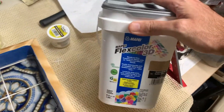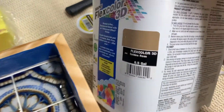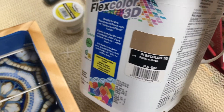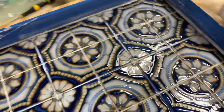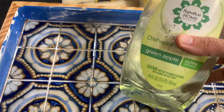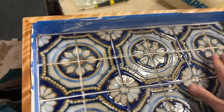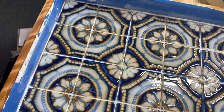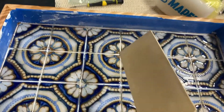I'm working with a grout I haven't used before — this is a sparkle grout, like an epoxy grout, and it can be really tricky. One trick is to wet the tile and even put some diluted dishwashing soap on it. This is a Mapei grout — they give you a sponge and scrub to clean out the epoxy grout because it can be extremely tricky. This is a pre-mix, it already has liquid in it, so I'm going to lay it down and push it with a little grout float.